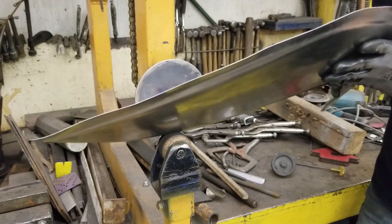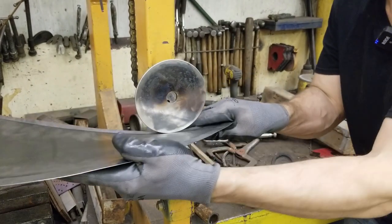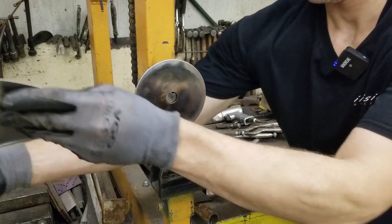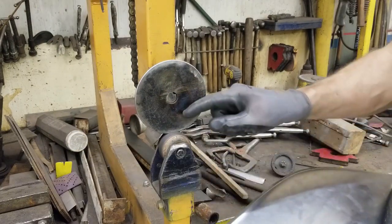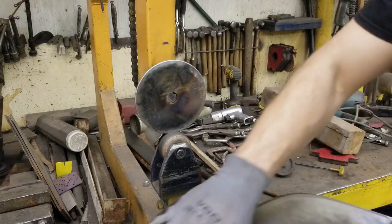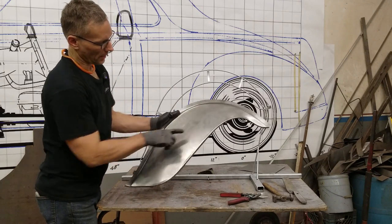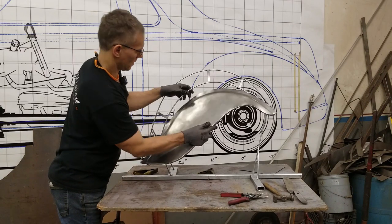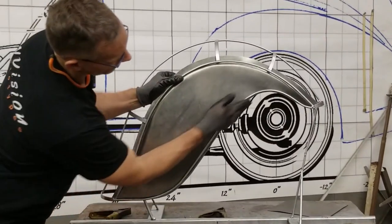We're getting just about there. We can take over the rest of the way with a hammer and dolly, but that's not for this video because this is a bead rolling video. So there we're getting the beginnings of a nice flange all the way around. And we're actually getting a bit of a feature here because we're sinking into the skateboard wheel. When I take and roll that over, some of that will disappear, some of it won't — but it looks pretty cool. So we just finished rolling that over and it kind of softened that radius up. We can go in and flatten that out a bit more, but I'm kind of liking the look of that little feature on the edge. That fits the edge quite nicely.